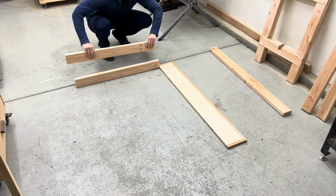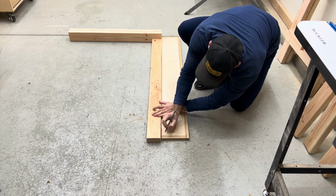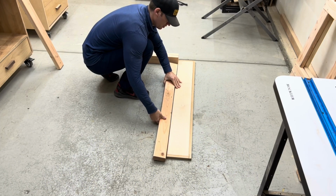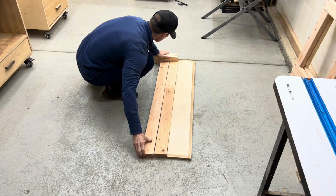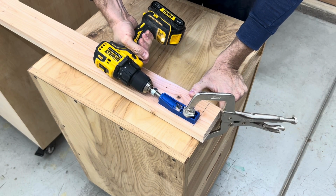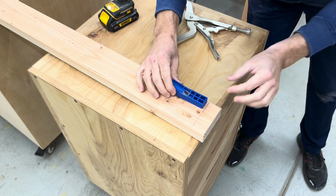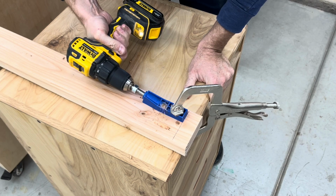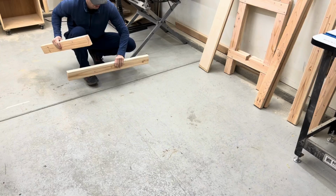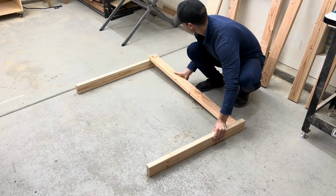Okay, we have the tabletop built, we have the leg structures put together. Now it's time to build the workbench base, and don't worry, this base will be very sturdy because of triangles. I cut the long pieces to their final lengths, and now I'm going to use pocket holes to assemble these pieces together. At the beginning of the video, I only showed myself cutting 4 legs on the miter saw to the exact same lengths. I actually cut 6 legs because 2 of those legs are shown here, and they will be the legs of the workbench base.